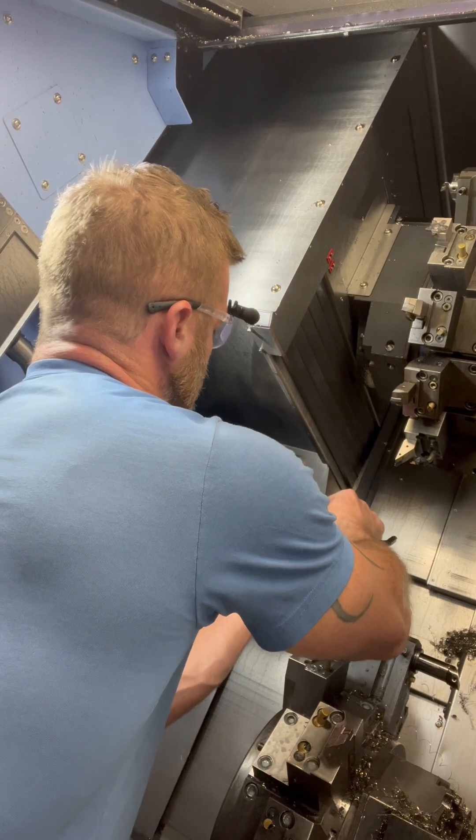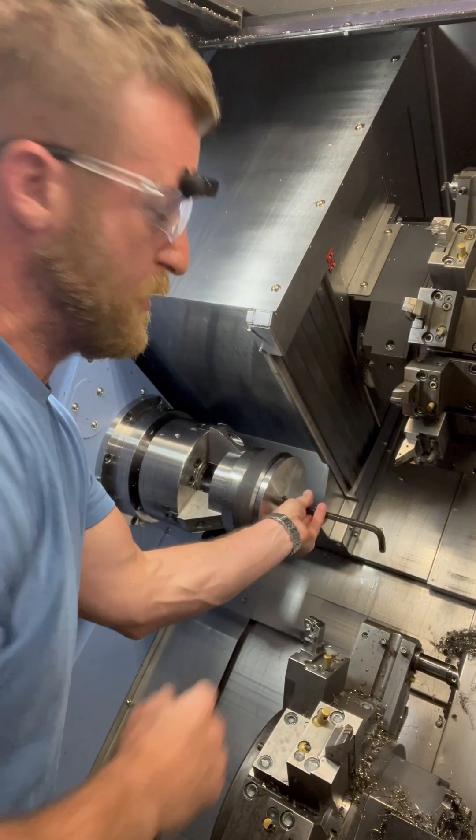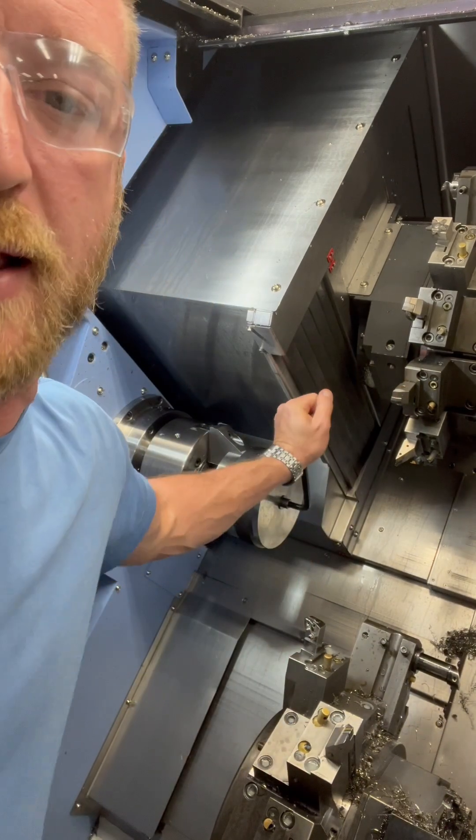Keep in mind, the benefit to this — it's going to be a little bit, a few seconds longer loading than just a hydraulic chuck, but there is no external force that's going to triangulate the part.